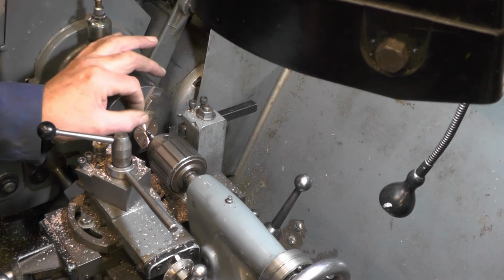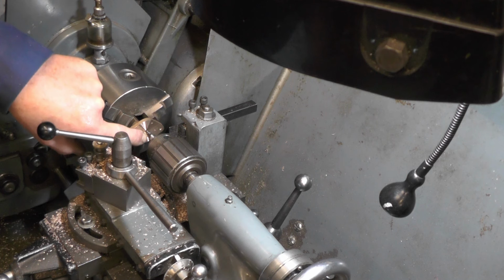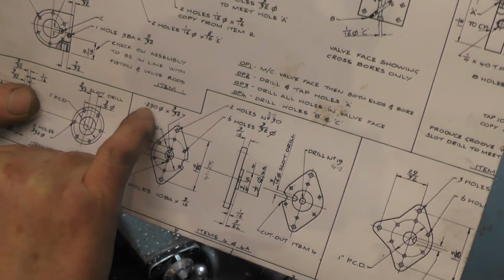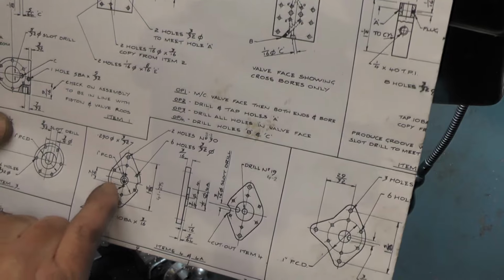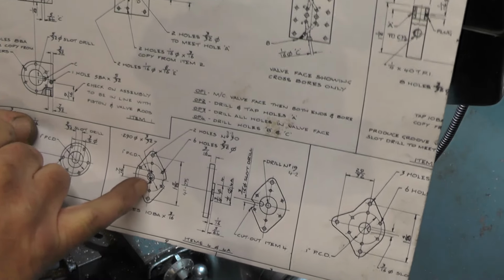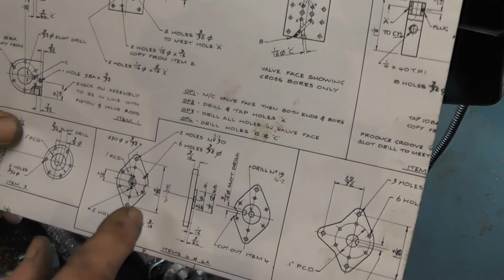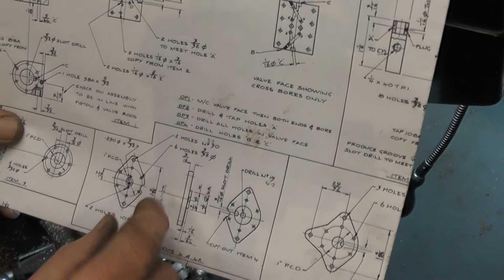So I've got this width down to 3/16 now, and I'm now ready for putting the counterbore in the reverse side where the stalk was for the gland o-ring. So looking at the drawing then, it's a 0.290 diameter by 3/32 deep counterbore. And once I've put this counterbore in for the gland o-ring on both of them, I'm back in the milling machine to put two 10BA tapping size holes in at 7/16 centre. So I'm having to go back in the milling machine because I'm doing it on the reverse side from what I was working on. It's the side where the stalk was, what I was gripping on.